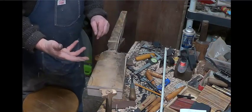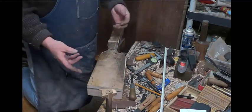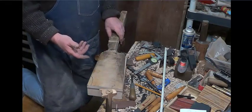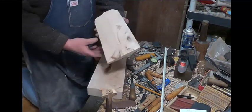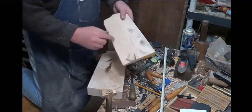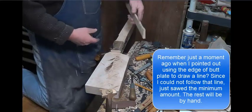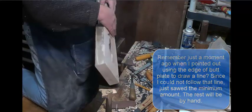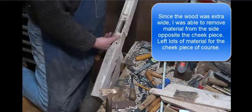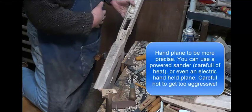I've now got done sawing it out, and I'm glad I'm documenting this because I'm not going to believe it myself — the bandsaw blade just broke when I turned it on, it snapped. Which I guess is better than it breaking in the middle. So I had to use my table saw with two cuts, top and bottom. I took a Japanese saw and sawed the little triangle that was in the middle. I reset it for the other thickness and cut it off. Now I'm going to clean this off and get it closer to the line — I'll do that with a plane.